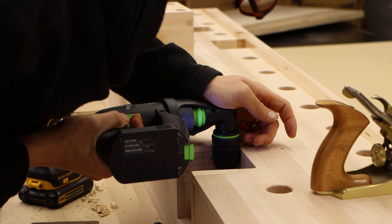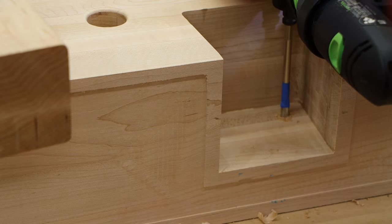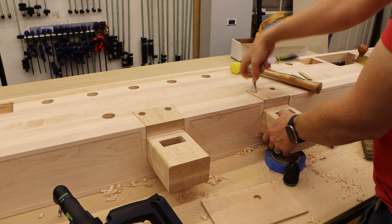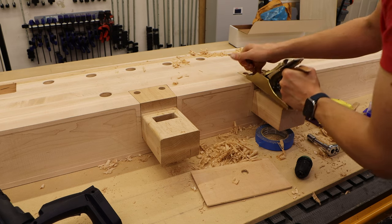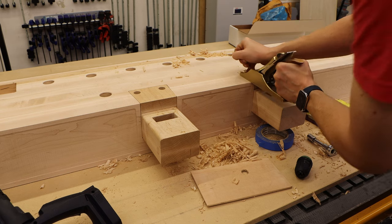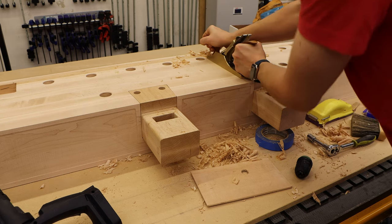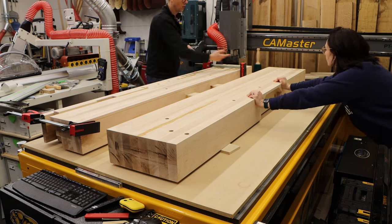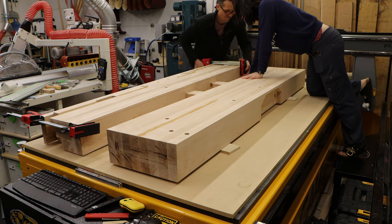Now the loose tenons are permanently installed using the same process I used on the linear rail carriages: first drill the holes, second tap the holes, finally add bolts. I made one of the wedges slightly too tall, and this is a good time to ensure everything is flush. Another one of those moments of truth — the initial mating of the sliding and the fixed slabs.